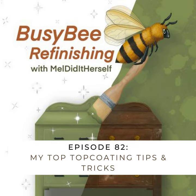I do multiple thin layers of polyurethane instead of trying to get a thick dense finish from the get-go. On most pieces I'm doing three layers, and if it's something high traffic — like a dining table or kitchen table — I'll do on average five coats. At a minimum you should do two coats: the first layer looks nice, but the second really evens out the finish, and a third layer helps correct any spots that were thicker or missed.